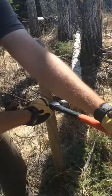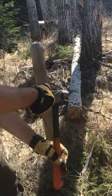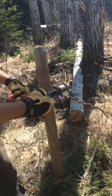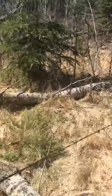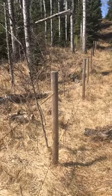As you're doing it, if you look up and down the fence and you can see any fence posts moving, you've got staples you need to loosen. You can pull a fence post right over by tightening like this. We seem to have done an okay job of that — I can see we're getting nice and tight in both directions. As you can see, we've taken most of the staples out all the way up that hill.